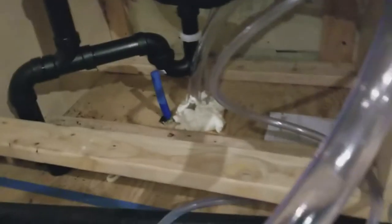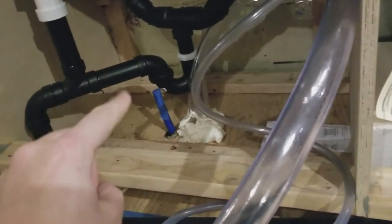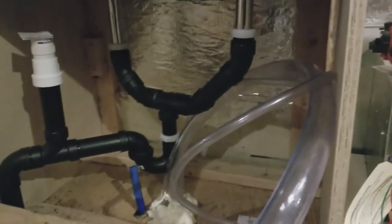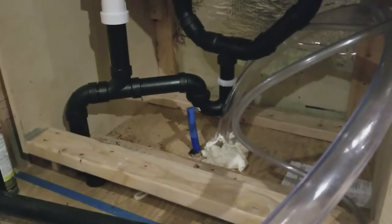The air vent just allows air to flow freely in and out of the tank so that the tank doesn't implode or get overfull — it just keeps it equalized. There's also this fill line, which is three-quarter inch PEX, and that's going to be for the city hookup. I'll have a valve I can flip that'll allow me to fill my tank while connected, so we can continually use city water for all the appliances bypassing the pump, and in some downtime I can just flip that on and fill up my tank.